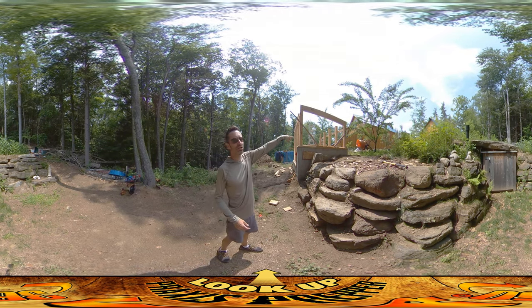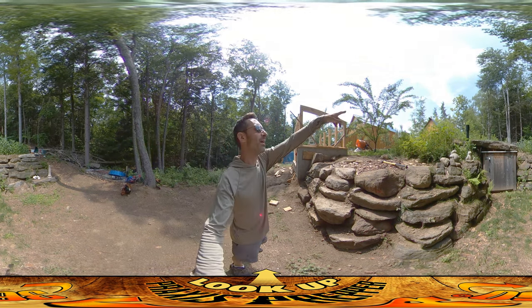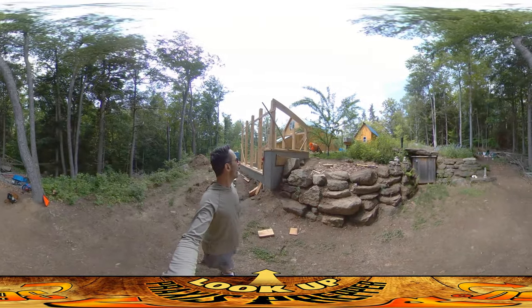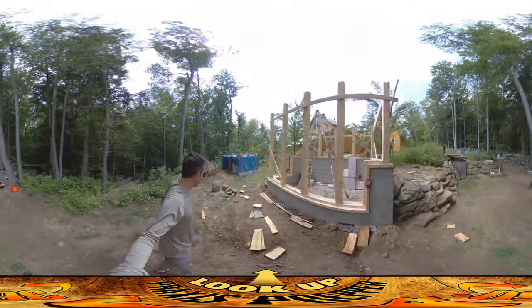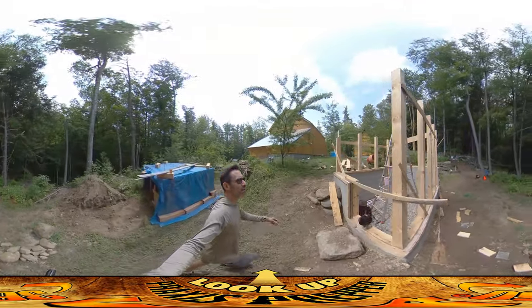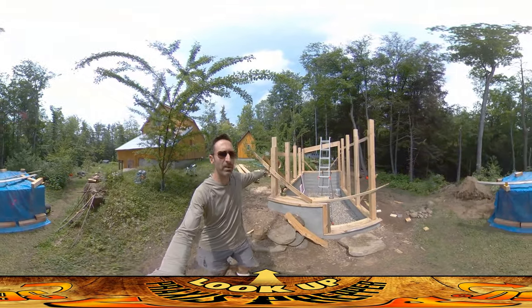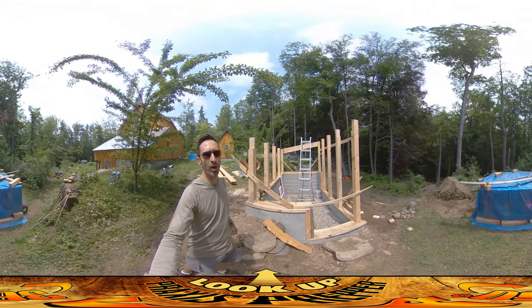You'll notice that this roof pitch here is much shallower than any of the other structures we have here. The shed has the steepest roof pitch — it's a 45-degree angle because it has the solar panels. But the reason this one is so much more shallow is because this place has a green roof. You don't want a super steep pitch on a green roof because all your dirt and plants are going to get washed off.